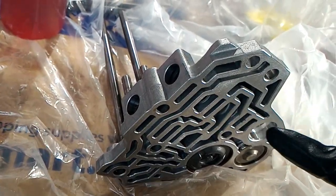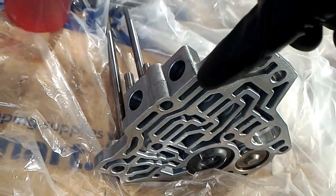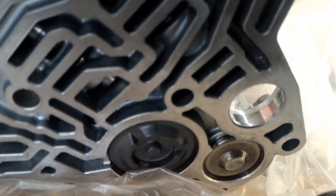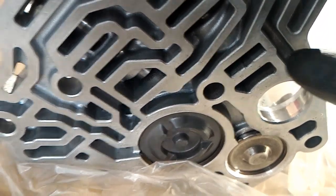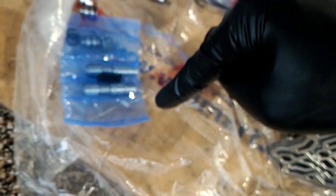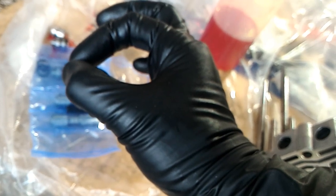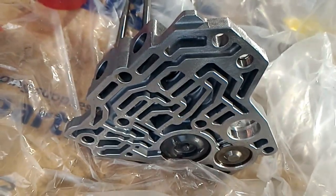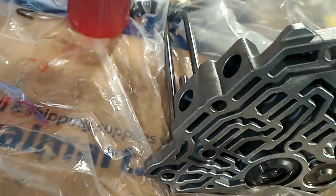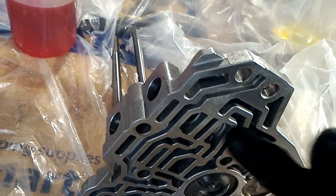The spring is down here and the valve is already in. You can see there's a cutout, like a channel at the bottom. What that channel does is: it goes here, then there's a circle, and the channel comes back out. The spring sits into that little groove so it actually gets locked in at the bottom. I'm thinking the channel is for lubrication, or it might actually be where the pressure is pushing up against it.